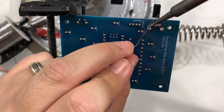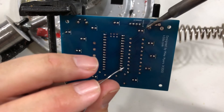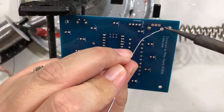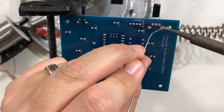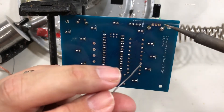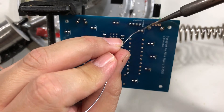Same thing with the potentiometer — it has even bigger holes so it takes even more solder. These are not electrical connections; they're just to make sure it's physically connected to the board so when you start pushing or pulling on the knob, it'll hold it there — it's not relying on the signal pins for the physical connection. Let me solder the pins.